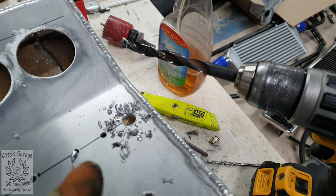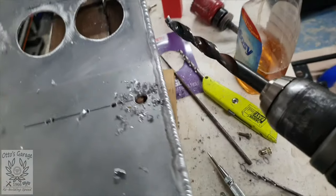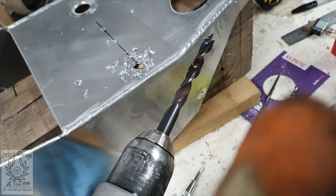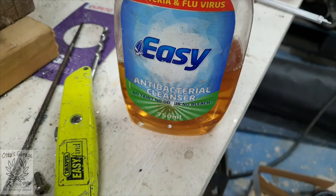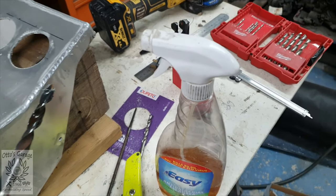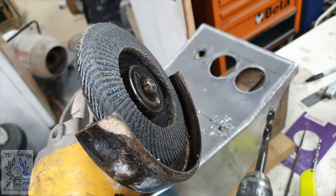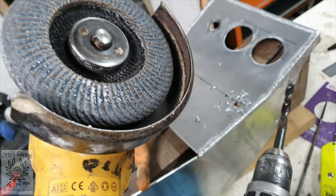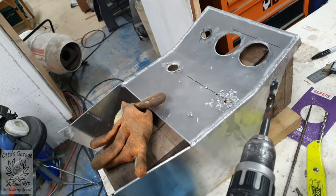Another little tip when you're drilling aluminium: because of its nature it sucks heat out of everything and the drill bit can just spin on the surface. When I was up at Paul's — the aluminium fabricator — he gave me a top tip: just use some WD-40. I've soaked it on the drill bit so it's always lubricating as it drills down onto the workpiece, and it really does make it a piece of cake. I keep it in an easy squirt bottle — much cheaper than an aerosol. He also said to put WD-40 on your flap wheel before working aluminium and it'll stop it clogging up. People throw flap wheels away because they seem to go blunt, but a bit of WD-40 will stop them clagging and you'll get much better value out of them.